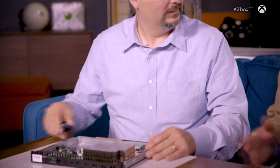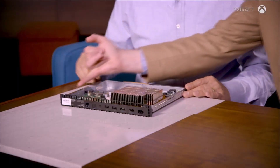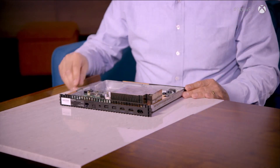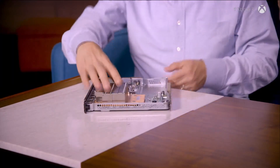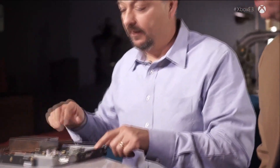We also have to provide shielding for the radios while keeping them working as well. The problem is we have all of this energy inside which can cause interference, but we need wireless and our controllers to be able to communicate. We actually mount the radio outside the container so it's isolated. We're able to utilize the same level of technology already used in Xbox One S for our Wi-Fi and accessories radio. We have two separate radio modules — one for Wi-Fi, one for Xbox wireless accessories.